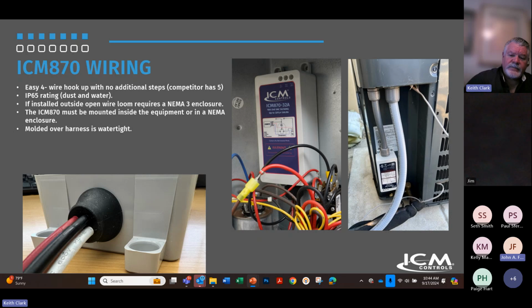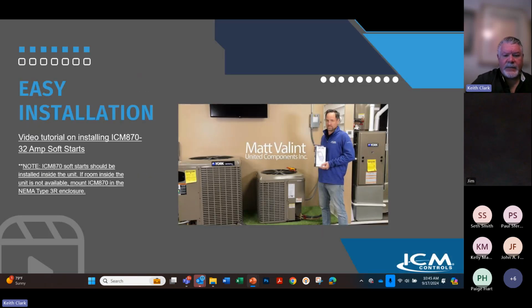Not really. It's more with the way they've got it here with those sealed tight whips, this is probably okay because those are all sealed. But if they didn't have that sealed tight whip, if they just used the ICM harness or something like that, then you wouldn't want water building up on that boot and then freezing. If it froze, it could split that boot, and you just don't want to take that extra chance. We like the water to drip off, if at all possible, away from the product. Yeah. Water and electronics don't mix last time I checked.